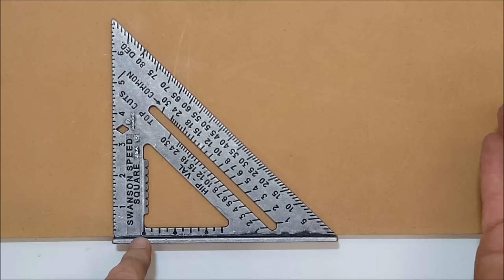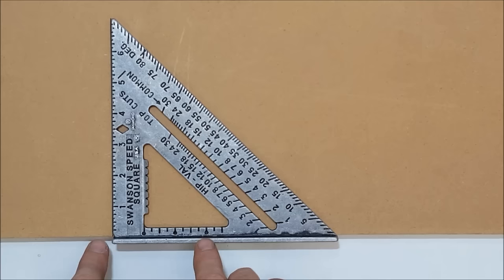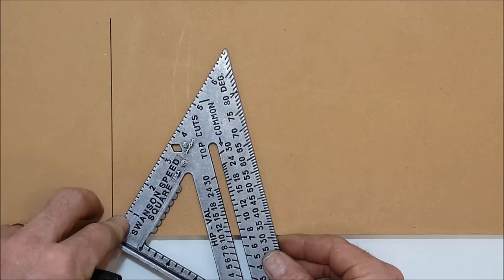You can just use the protractor to find the angle. So I'm going to draw a 90 degree mark just for reference and to start my pivot point. And let's just pick a number like, I don't know, 31. So let's say I have 31 degrees. I'm going to roll at my pivot point on my straight edge. I'm going to roll out to 31 degrees on the protractor.